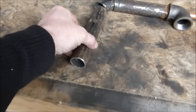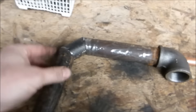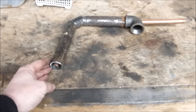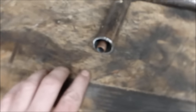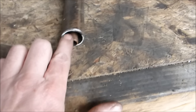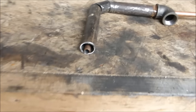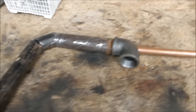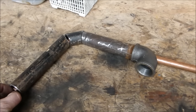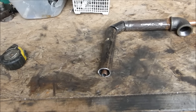Here's my seven inch piece, and you can see that all these angles make a 90 degree bend. The oil comes out that half inch pipe, and the air comes out the space around it — so it's like a little blower. The air comes out around the pipe, and oil just travels down the half inch copper pipe. At no time is the half inch copper pipe pressurized. The air travels around that copper pipe, keeps the pipe cool, and stops the oil cooking as it travels down it into the fire.